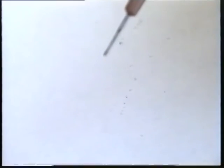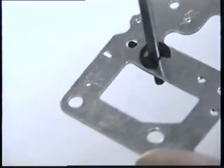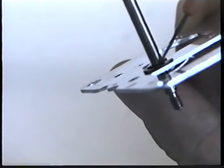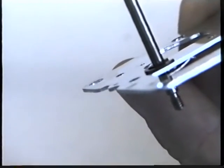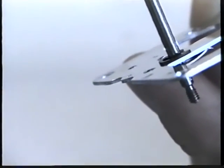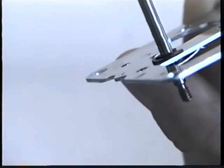We apply oil from the oiler to the inside of the plate between the arbor and that circlip. Failure to lubricate there, and you'll find that as you're turning the alarm set arbor, it gets tighter and tighter until eventually it seizes.